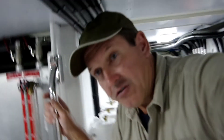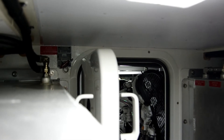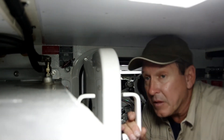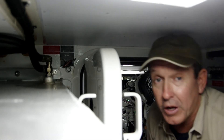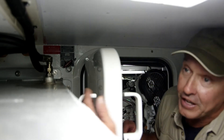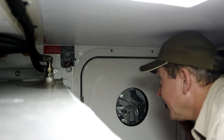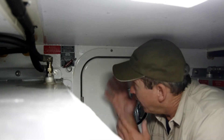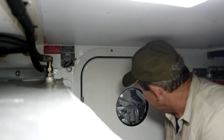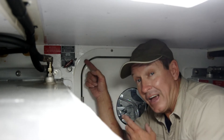Let me show you what I mean, because there's nothing in the world that says a manual pull station has to go in any particular spot — it can go anywhere it's going to work. In this particular boat, I went looking for the pull station and found it right here. Here we are at the door going into the engine room. There's our pull station up here in the corner, just outside the engine room door. It's a beautiful installation because you can come down, look through the window, and if you see a fire condition in there, you can operate this out here safely.